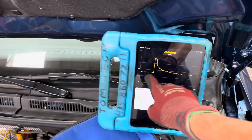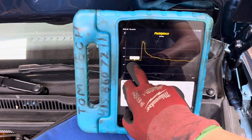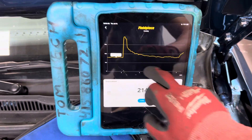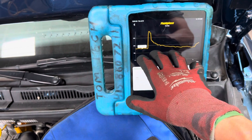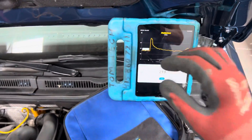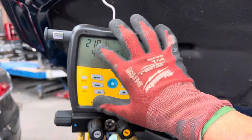As you can see here, there was a blip — we were at about 159 microns, then it jumped up to 300-something, and then came back down. That is moisture or refrigerant bubbling out from deep puddles of oil within the system.